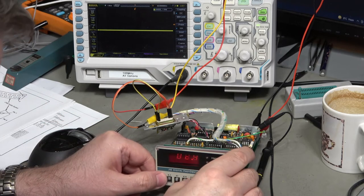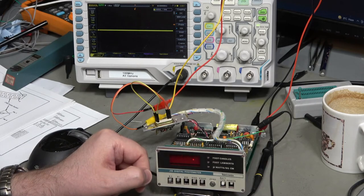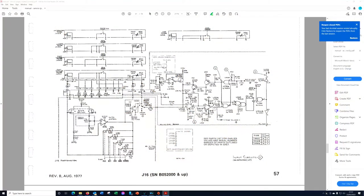Pin 1 is the input, pin 2 is ground - there's a short circuit pin. Short circuit should be connected between pin 8 and 15. With that done - oh yeah, interesting, we've got a reading! It's all over the shop but there's definitely a reading. And should be on times 10. Looking at the circuit diagram - on the left at the bottom we've got the first stage of the input, which is essentially an attenuator and amplifier circuit. Each probe has a little trimmer pot to enable gain adjustment, and that trimmer is within the probe casing itself.